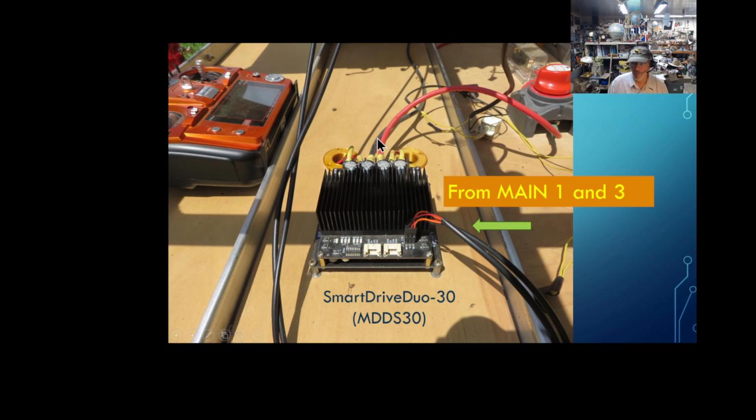You have to use a battery for the power supply. You cannot use a bench power supply. It's got some peculiarities in the wiring. Also, there's no reverse polarity protection for the wiring here, so if you do unfortunately turn it on with reverse wiring, you're going to definitely release the blue smoke. Don't go there. Check and recheck.